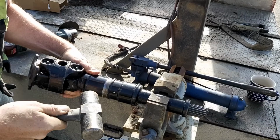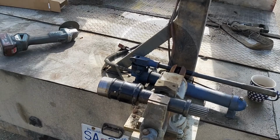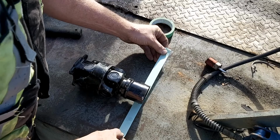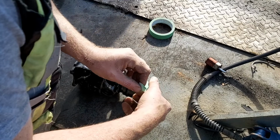And I've just taken it apart here. What you're seeing on the inside isn't quite normal. There's a slug in there, and I just used that to extend it for the previous modifications. I cut it a ways back from what we needed because I figured I wanted to face up the two faces to that little groove you saw there. That way, I don't have to make a precision cut on the outside pipe wall. After all, two machine faces are going to be touching each other, and then we're just going to weld it together.